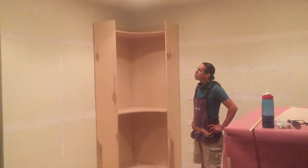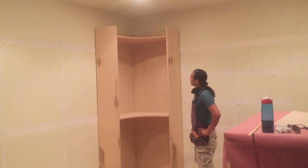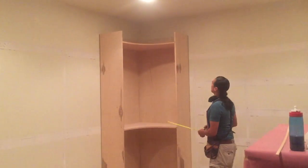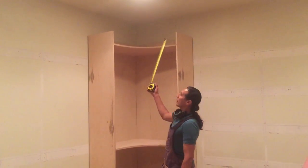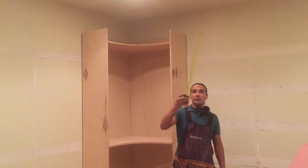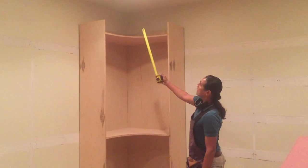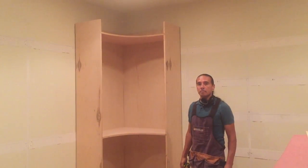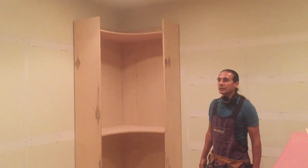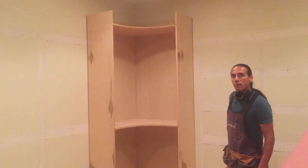At the top here, you have that gap — what's going on there? Once it's butted up against the ceiling, at the top we're going to run a crown molding that's going to go around the whole closet except for the door. It's going to be all wrapped up with some nice eight-and-a-half-inch crown molding — a massive crown molding at the top. And then there's that airspace at the top, but you're really maximizing the space with that bend all the way around.